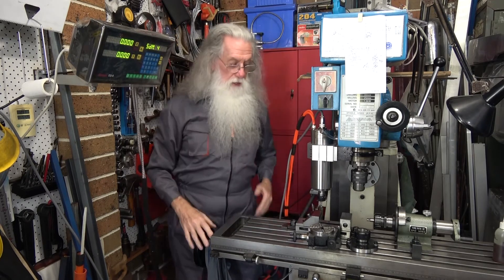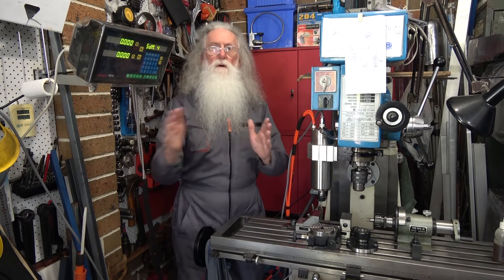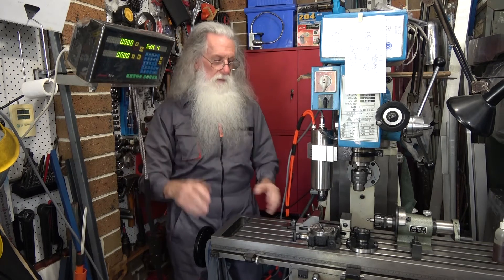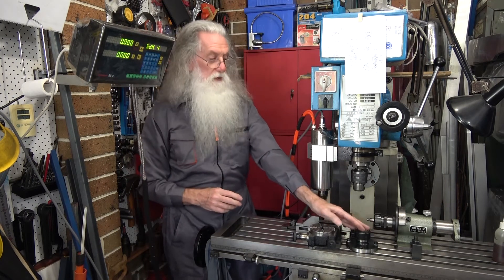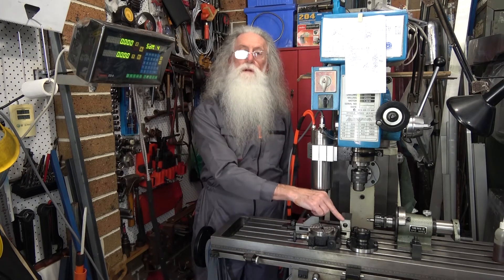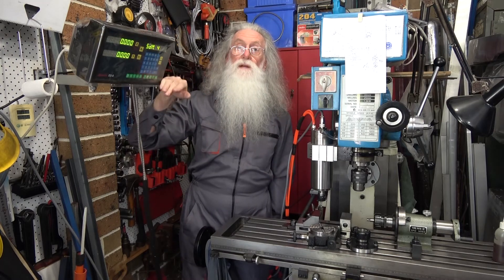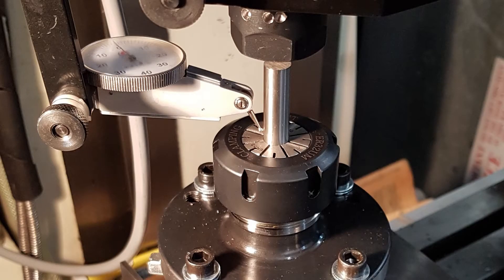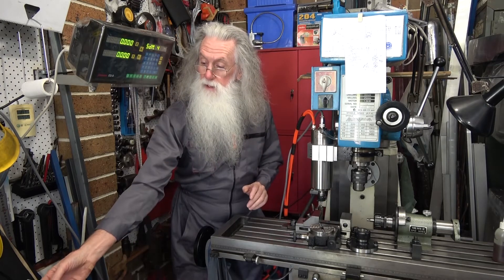The second example is Donkey, who used to clock up and do his job — 45, 75, 150 and so on. Then he might put another job holding fixture on, go over and clock that up, and he'd lose that first position because he was just staying in incremental mode and not using the SDM. So if that first job came back, he would have to clock it up and set it up all over again every time.